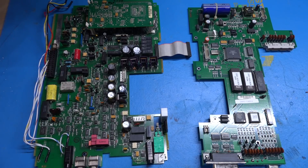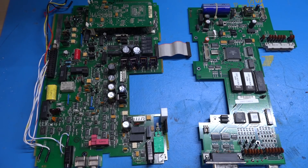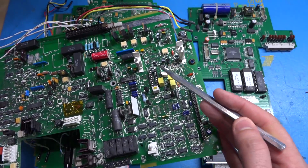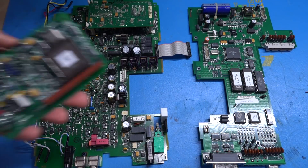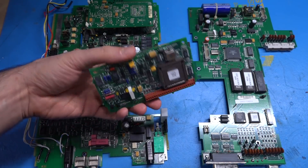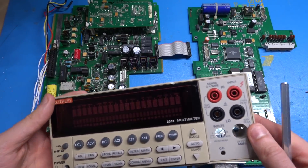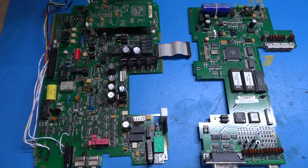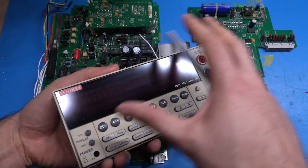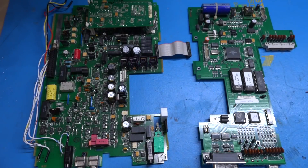It's hard to test without putting it all back together. I cleaned the board very carefully — even a few nanoamps of leakage current will throw this thing off because it's so sensitive, especially around the A-to-D converter board and the sensitive analog circuits. Underneath, you can see the voltage reference and all the analog circuitry for the converter, which is based on an Altera FPGA. The display that came with this original Keithley 2001 has a small nick at the very top; I do have a display from the old unit that doesn't have that nick, but I'll use this original one initially since it looks a little bit better.